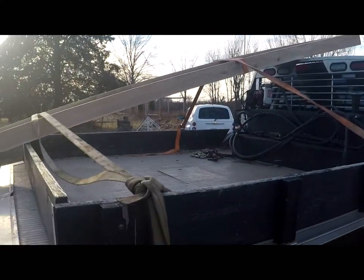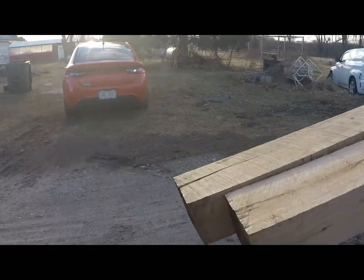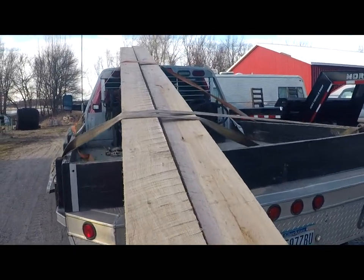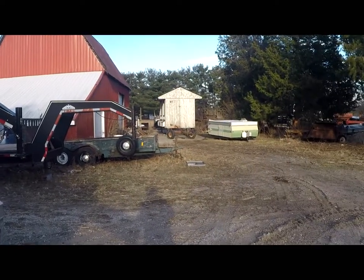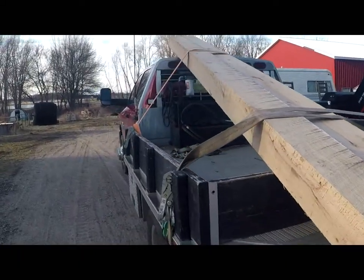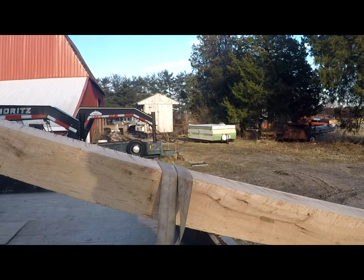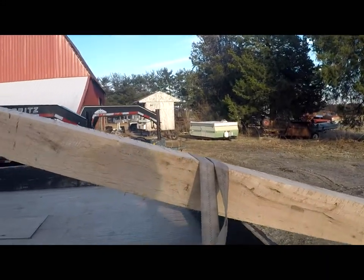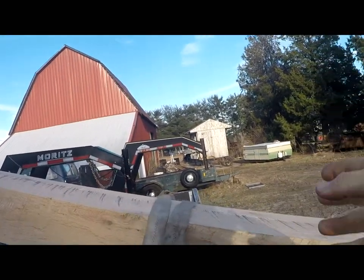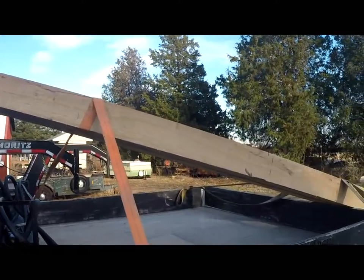We also got our freshly milled beams today — between mounting tires yesterday and helping my buddy cut wood for six hours today, I'm pretty sore. Instead of going with an eight-by-eight I went with an eight-by-six to cut down weight, and these are 16-foot. I was going to go with 12, but figured the 16s might give me enough to put a walk plank on the front and a platform on the back for a 55-gallon drum for water and a box for feed. I'll get these unstrapped, set them on the running gear, get them measured up, and start mounting — need to make four pieces of angle iron brackets to mount the coop to the beams.